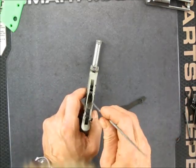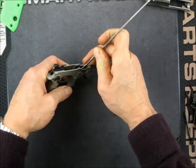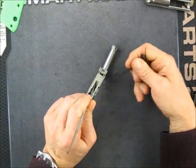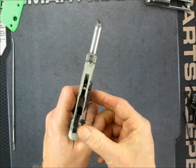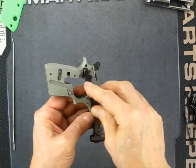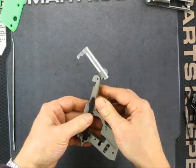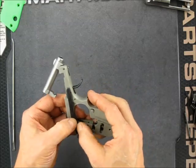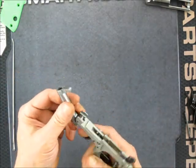So to get this in there, I'm going to reach in here and get this little spring and push it forward, because it needs to go to the front of that bar that's going to go in. So then this pin goes through the holes in the top of the trigger, and that spring sits behind it right there. I'm going to pull that back out just slightly so that I can engage the sear properly. Then get this spring in proper position — the straight part fits in a little slot and then the curved part goes under that draw bar into a little groove. That's in place.